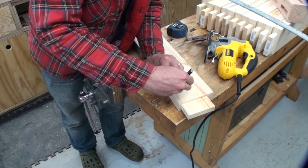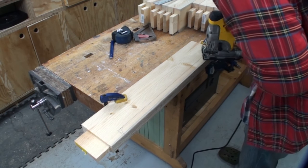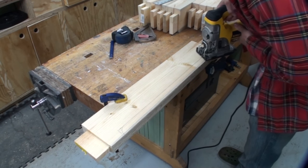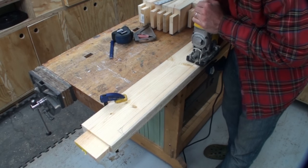Most of my apron boards are on the wider side, but in situations where I want to allow a little extra leg room, I stick with my wider apron board and then I'll cut out a relief area. Normally, I just take out about an inch and then I'll do some sort of simple transition from that 1 inch relief back down to the full width.